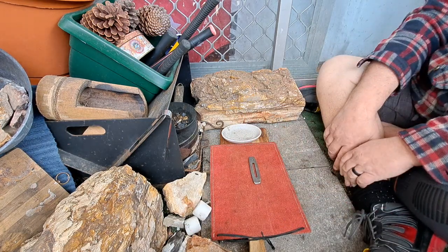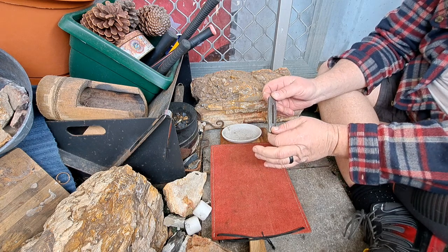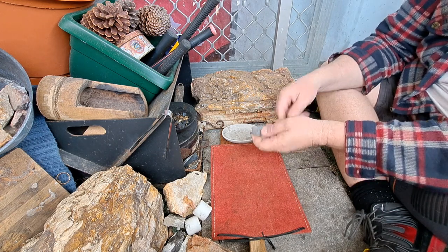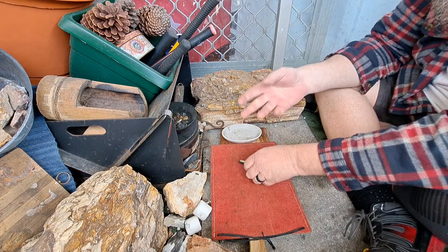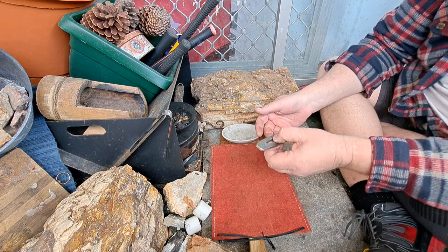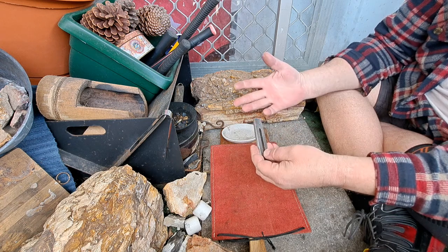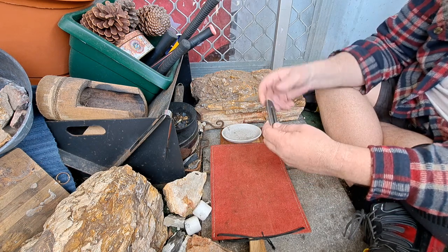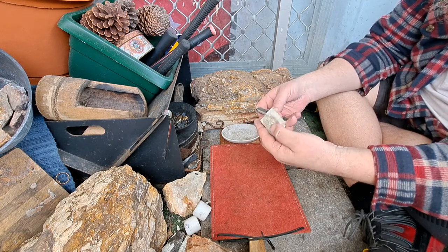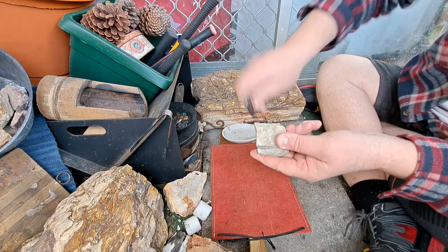File strikers are really good. I love them — I'm snapping them off and just using them as they are. Eight times out of ten they'll work all right, but they do temper them, putting them in an oven and bringing their hardness down a bit — that's just in case you drop them so they don't snap. But strikers have got to be as hard as they possibly can to get the best sparks, so that's why these are not tempered. I don't temper mine at all. Putting them in the quench tank you'll probably get them to 65 Rockwell to be able to get them to spark. This is on quartzite — that's fairly blunt, but as you can see, this one sparks really well on either side.